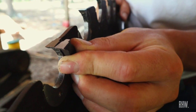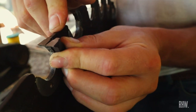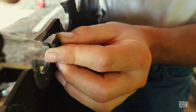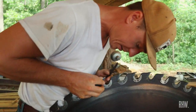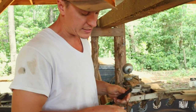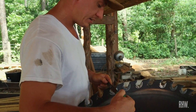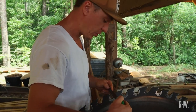You can see this brand new one's a little longer because I've only taken a filing or two off of this. Length by length you can tell this is a brand new tooth because it has a little extra length on it, and you can see this one here has been filed back once or twice. If you look down the angle of the tooth at the cutting angle, make sure they're the same — keep the new tooth as a gauge as you're working.